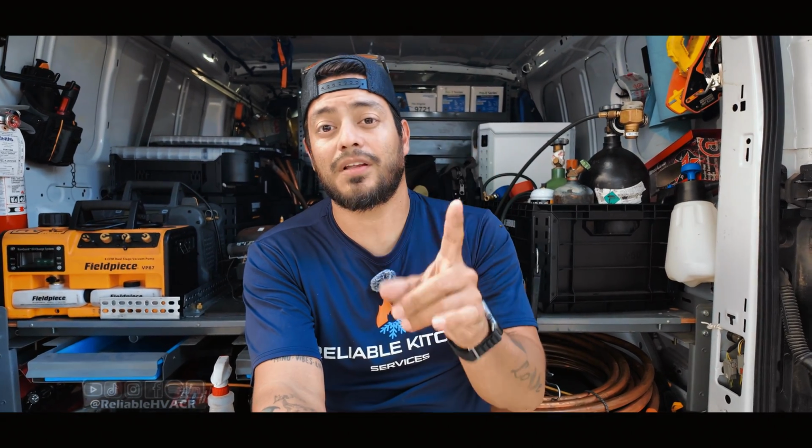And 3 of them have a basically identical way of grabbing the stem to a point where it can pull it out pretty reliably. I think that covers most of it. 2 of them have magnetic pullers, so once you take out the Schrader, or you just don't want to lose the end, you can put it on the unit and it stays there magnetically. And one of them has a rotating part where you put your thumb. When you're unscrewing it and you put your palm or your thumb on it, it rotates without spinning the middle, so you don't wear out your hand. So one of them has that.